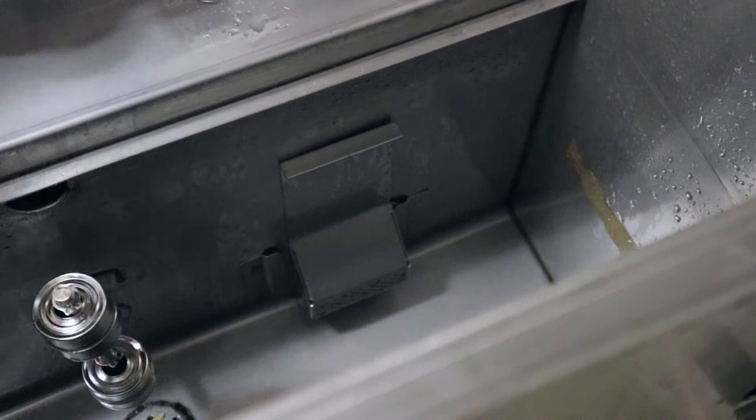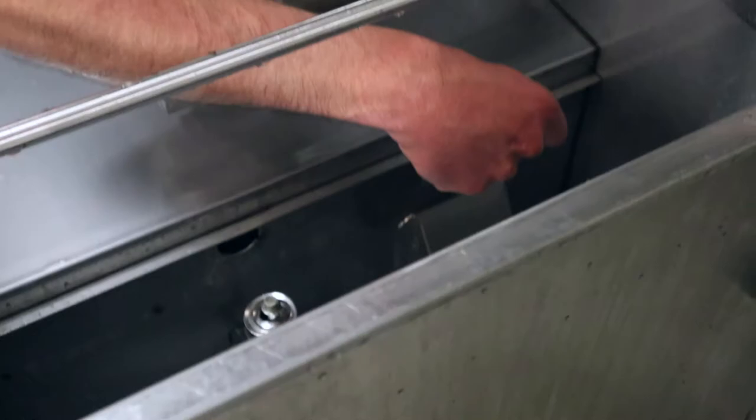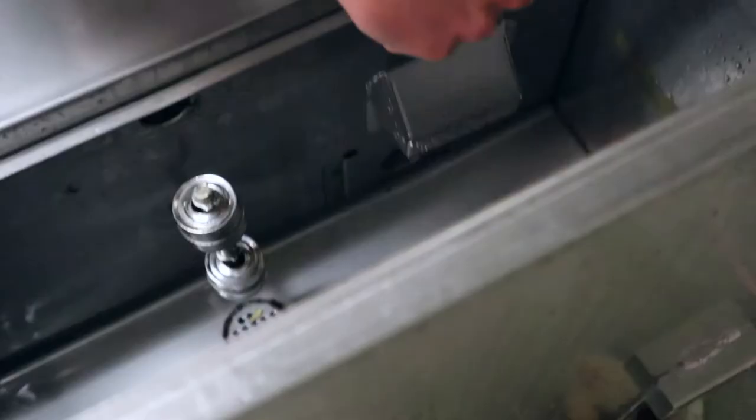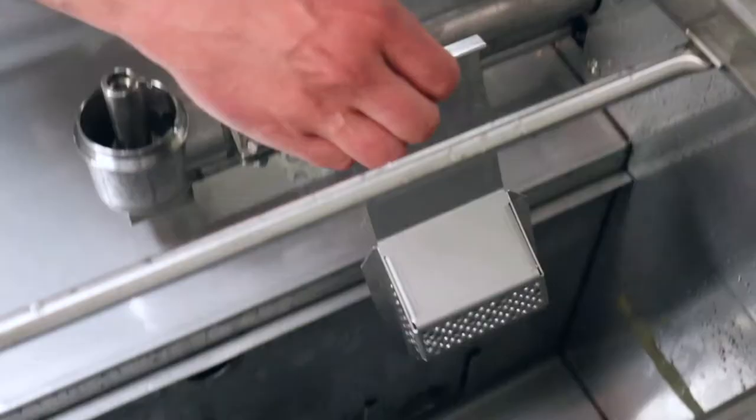Always give it time to cool down. Don't ever touch the heating elements down in here because those are hot. We're going to want to pull that straight up and straight out. If you want to see how it gets reassembled, there are a couple of tracks right there and it'll just slide right in on those.